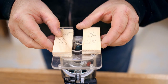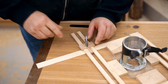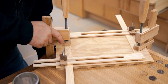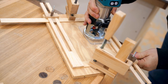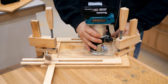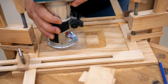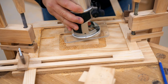You put those blocks in place and slide the rails over against them. I won't lie to you — it's going to take some messing around to get these blocks to the exact right size, but once you have them for that size bit, you have them. This is just a demonstration, so I've got a piece of half-inch plywood I'm going to clamp the frame down to in order to try it out. When you're using a router, you have to do it in a few passes to get to the right depth.